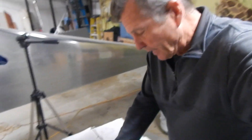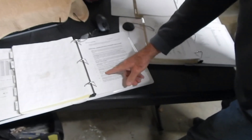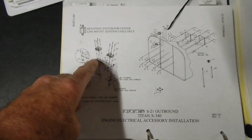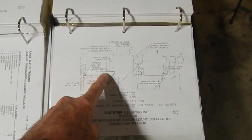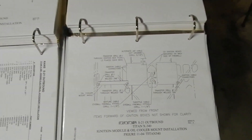We're going to get on to mounting the engine and there's a lot of prep work that needs to get done. The first thing I do is turn to the engine section in my manuals — there are checklists of things that need to get done. It looks like the next thing I have to do is the ignition coil mount, and I've got a firewall section too. This oil cooler mount angle is kind of hanging — I need to finish the firewall mounts and get this oil cooler mount on top of the motor before attaching the engine.